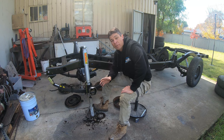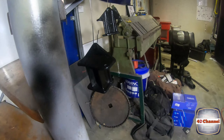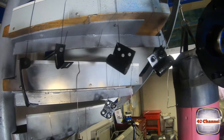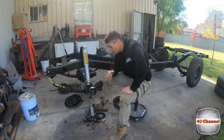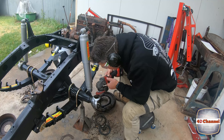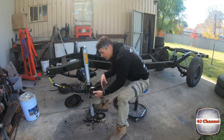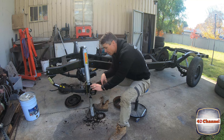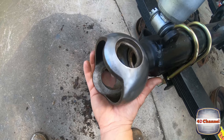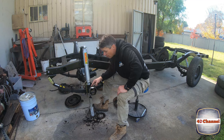I've spent a stack of time off camera just cleaning everything up, prepping it, repainting it, measuring and inspecting everything — checking what I needed and making sure I had everything to do the job. We've cleaned up the knuckle ball. Everything's cleaned up inside and outside. We've inspected the ball on the end of the knuckle — cleaned up the whole ball so there's no burrs, no nicks, no rust. It's in excellent condition.